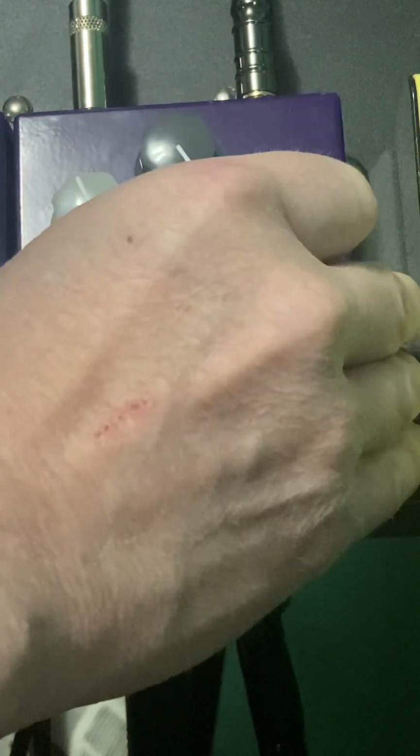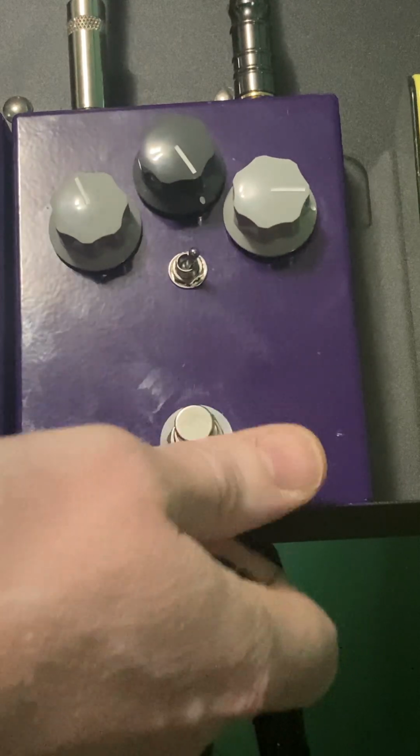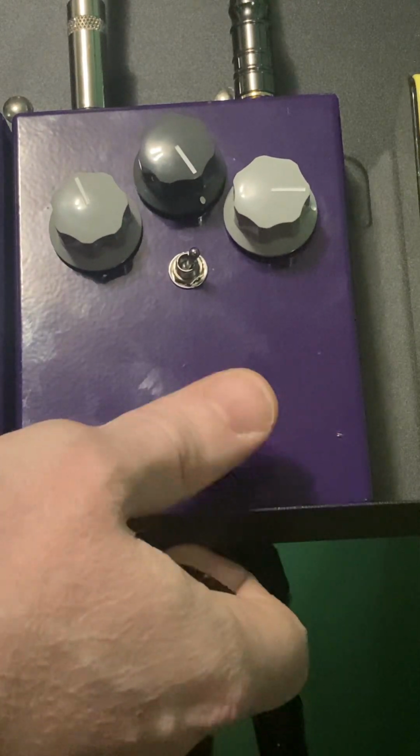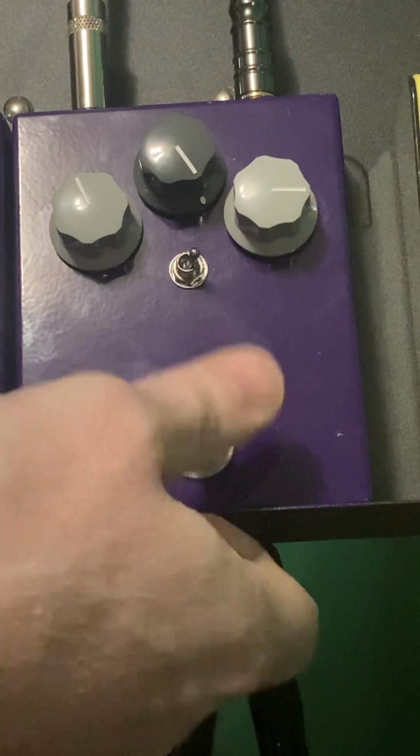Now let's hear the right side, which is, I think in this one, a 0.22 microfarad, so 220 nanofarad input cap. I could be wrong. It might be a little smaller, a little bigger. I don't know. Each one's slightly different depending on how I like the sound. But let's go to a bridge pickup here with this, and you'll hear it's a much sharper tone with more mid-range bite and more upper harmonics, because it's removing some of the bass from before the transistors.